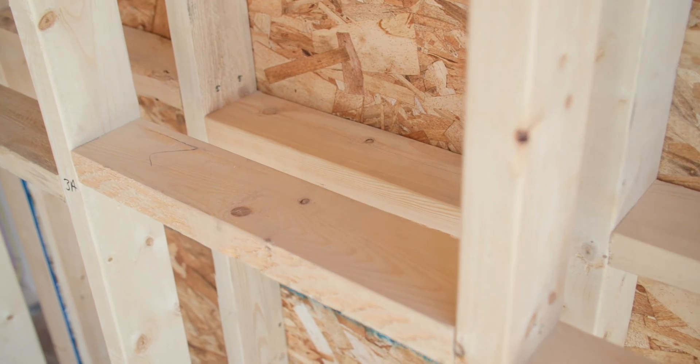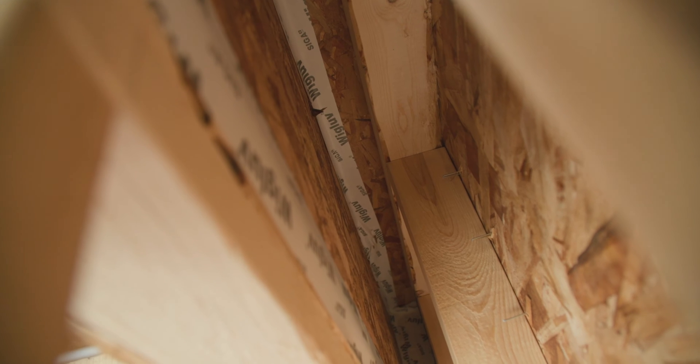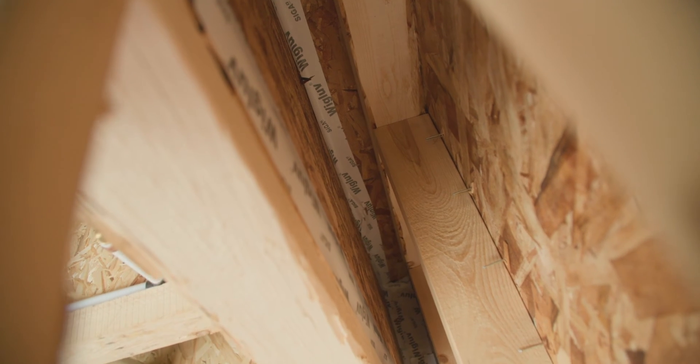We got quite a few comments about fire stops within the wall with our balloon framing. The insulation isn't continuous all the way up to the roof deck — our second floor sheathing comes across and ties into the exterior wall assembly, so there isn't a clear shot all the way up. That exterior sheathing would prevent a fire from jetting straight to the top.